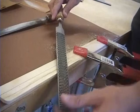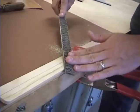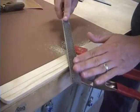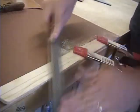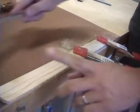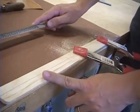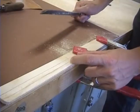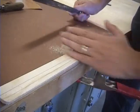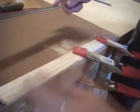After you're done with one side, move the clamps over and use the rasp on the other end. Again, work from tip to base and slowly remove the majority of material. This is going to be the leading edge, where you're only taking off about a quarter, so this side won't take nearly as long as the trailing edge. There's a small part in the middle you don't touch, because that's where the pieces will be glued together when they cross.